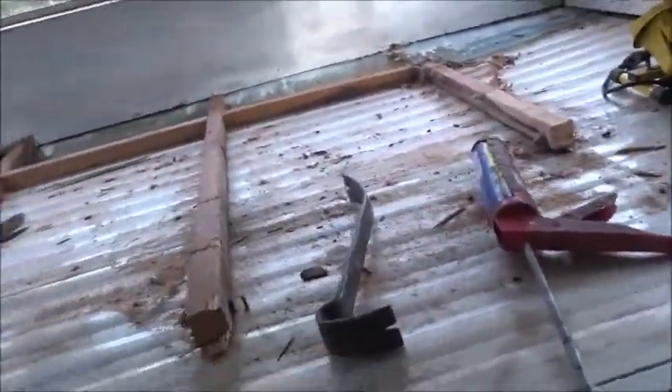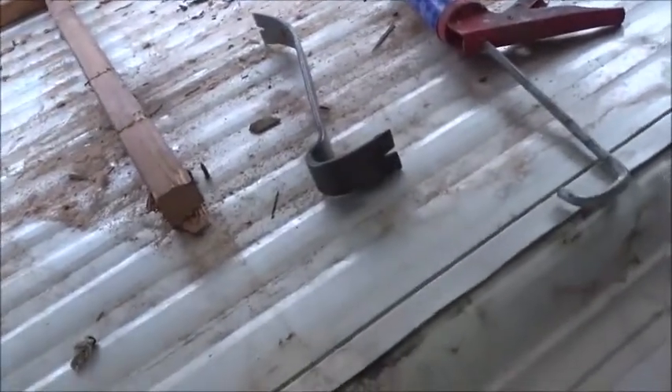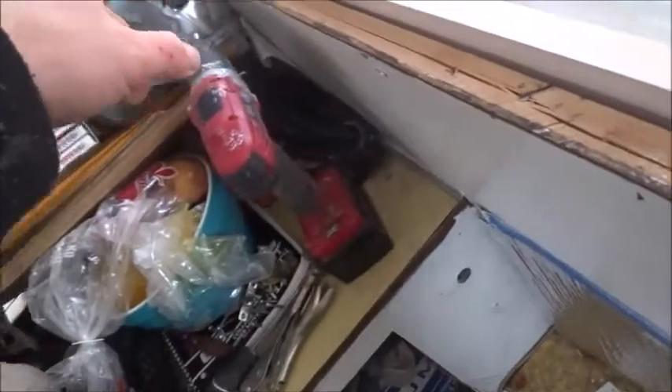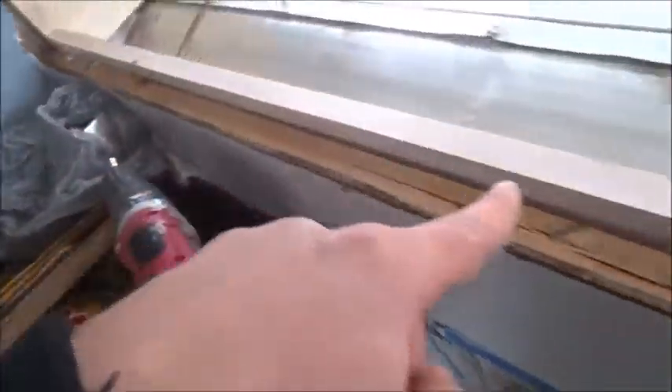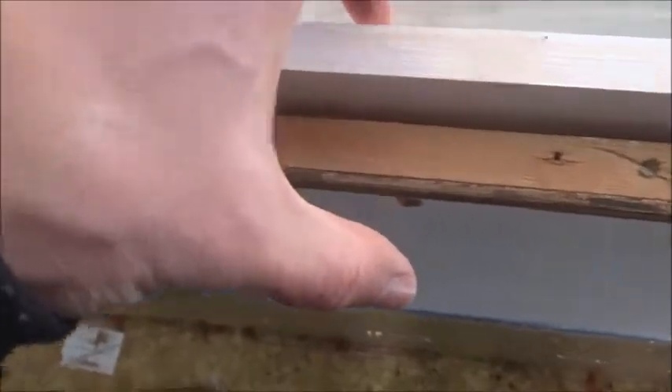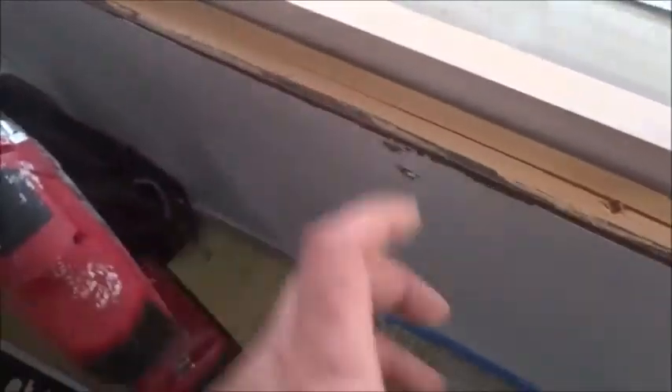Alright guys, it is a new day and I am about to frame all this in. I'm going to have to run to the store because I ran out of my sealer — well, I'm just about out of it. What I got going on here is I am sticking this piece in here, got it sealed up. I got some contractor's glue behind here — it's going to help hold it into place. I'm also going to run screws. What this is going to do is thicken this up and support this as well. Some of this is a little bit cracked and kind of thin, and I want this to be super sturdy. So I'm going ahead and tapping this in and about to screw that in.